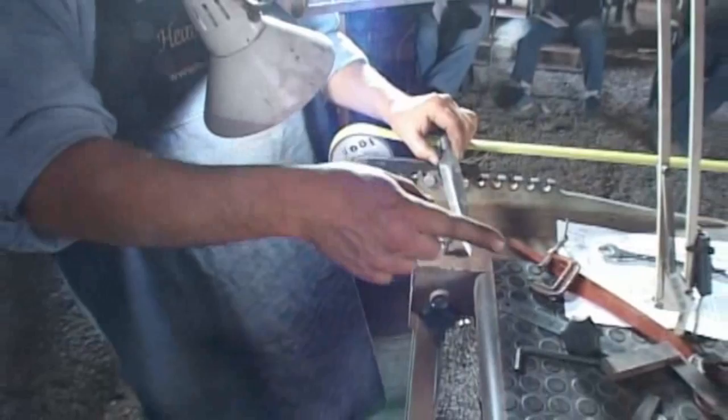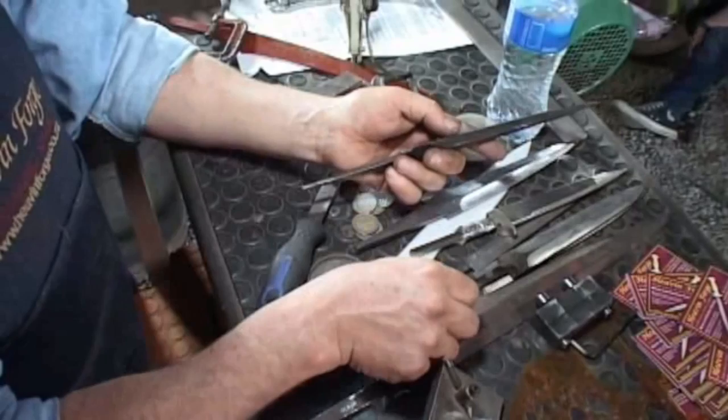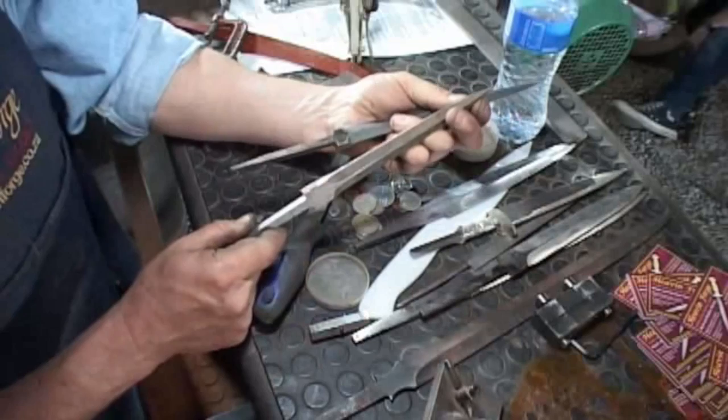All right, everybody. I hope you got the gist of it. I will pack away the tools, but what I will leave on the bench here is a couple of the other dagger samples. Some of them have been from previous demos. You will see the layouts. You will see the different blades that have been ground with different techniques. Somewhere I've kept the angle consistent and I've got a much more slender blade profile. Others where I've rolled the blade and landed up with a very heavy cross-section, almost like a square towards the tip.